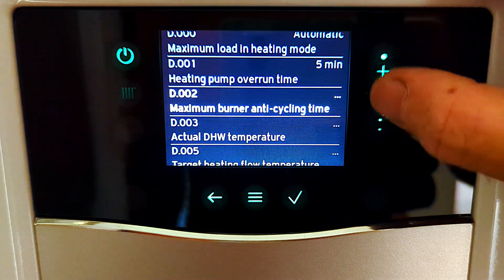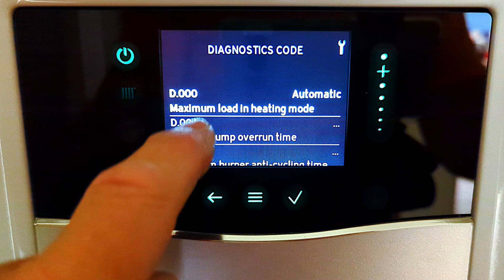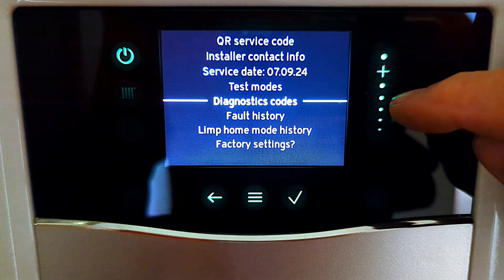We've got electronic self-test - I'm definitely not going to press that at the moment. Actuator test just runs the three port valve back and forwards, which is useful to know, although pressing reset does exactly the same thing. Then we've got the diagnostic codes which are the D-settings. What they've improved here is they've actually written down what they all mean, so you don't have to go back to the book. D000 adjusts the power of the central heating output - you can leave it on automatic or adjust it down to say 10 kilowatts so the central heating only runs at a maximum of 10 kilowatts, making the boiler more efficient. This is a 36 kilowatt boiler so hot water would still run at that if needed.